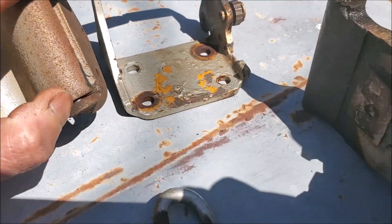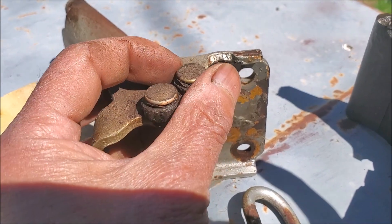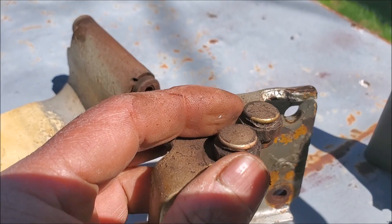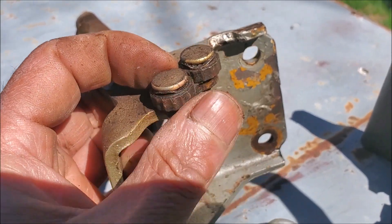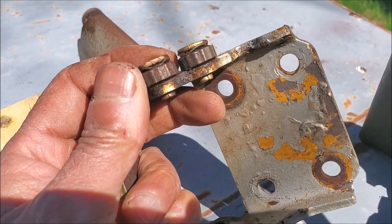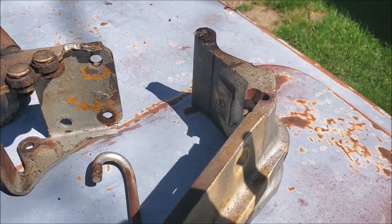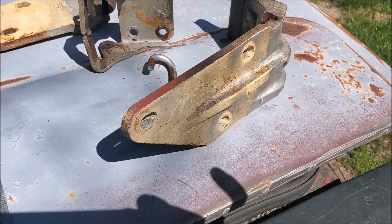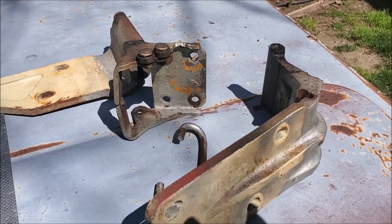These things here are what prevent the door from opening all the way — there's one stop and two stops. These are peened in at the bottom but they should rotate; one does, one doesn't. When you open the door it stops at position one and then position two. Anyway, this is one that's going back in my scrap pile — I just seem to keep everything and don't throw anything out. But that's my talk about hinges.